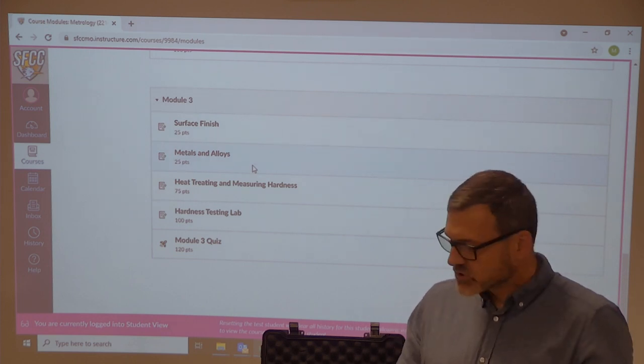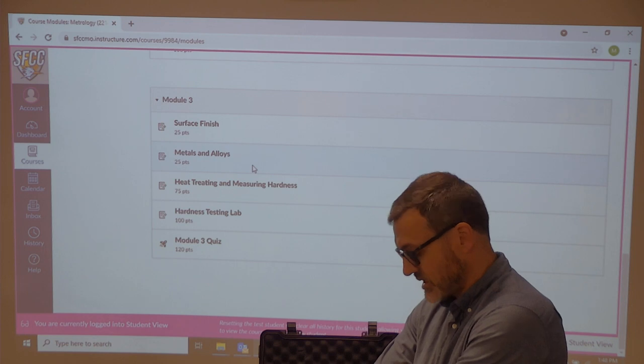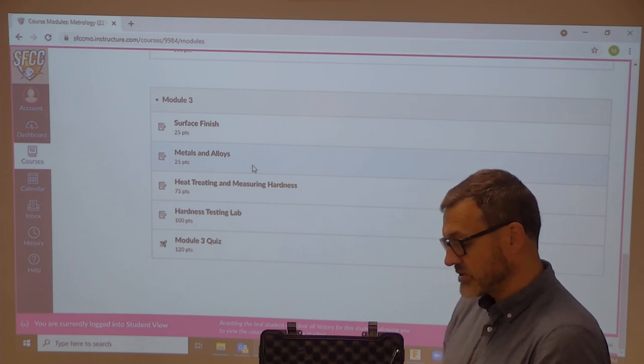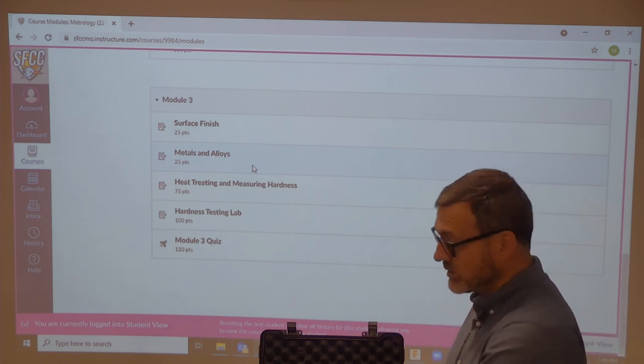So I've tried to check things that were like this. It's about 3/8 of an inch thick. And it's just not very accurate. So that said 47, I'm not sure. This is 62 Rockwell. So 47, 62, that's a mile apart from each other.